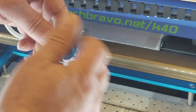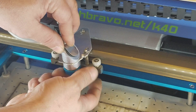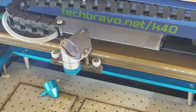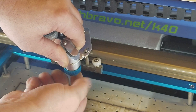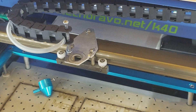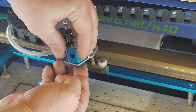That said, you don't have to replace the whole head. This lens holder will screw onto the factory head — install the lens, tighten the set screw, and you're done. If you want to do it that way and not worry about alignment or changing out the mirror, that would be the way to go. If you do want to change the whole thing out, simply unscrew this part and it'll come apart, then take this part loose, set it back up on there, run that through the bottom, and screw this on from the top.